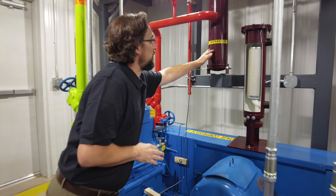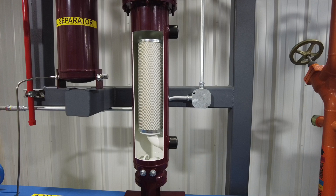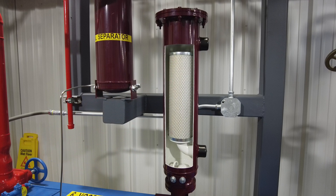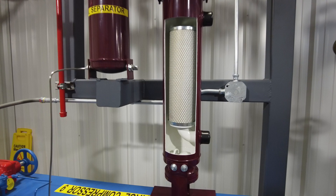Definitely an industry leader. When you look at this oil separator, here's a sister cutaway to it. You'll see there's a manway on top, so obviously there's something in there that a mechanic would have to service someday — this is a single coalescing element. What would be happening is this port right here is the discharge of the compressor going into the oil separator. The gases flow from the coalescing element inside out, and if there's any liquid oil, by gravity it falls. Hopefully the dry gases are allowed to go into the exit, which is the top pipe, and eventually come out as just dry gas.